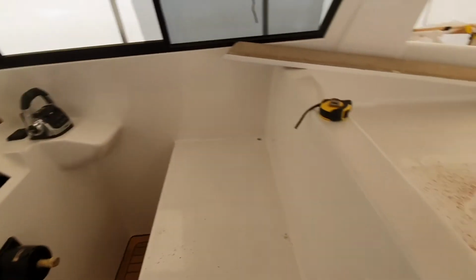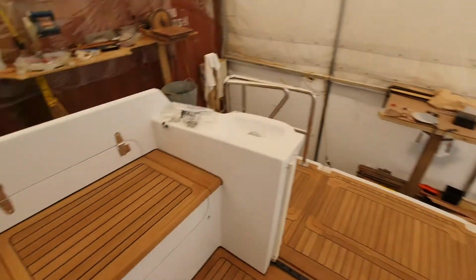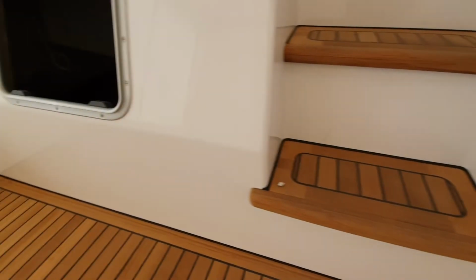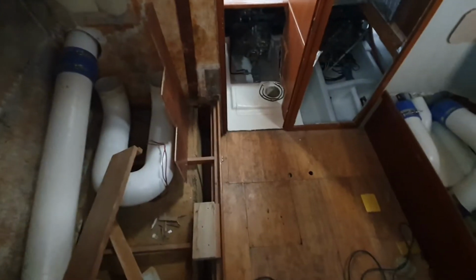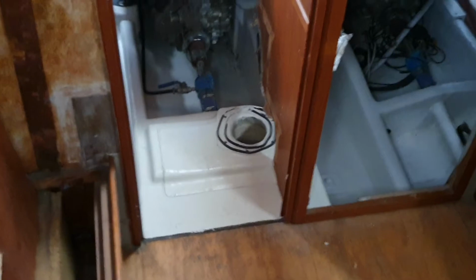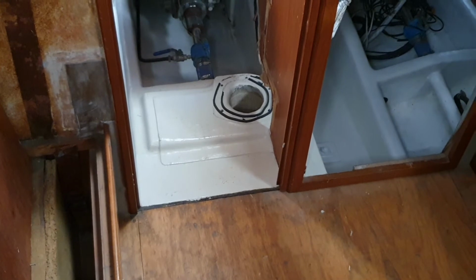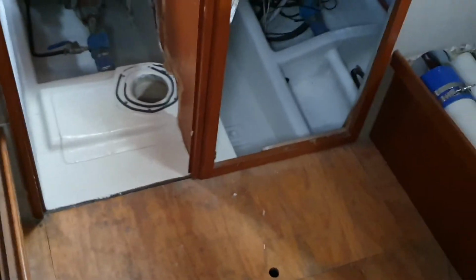Now the boat had a bit of a messy exhaust system all out one side, and I've built, if you can see it, I built that water trap muffler down there in place, and I've done all the exhausts. That's the starboard side. The port side, these are components, but I've boxed in between the engine beds and created a water trap muffler in that area, because there was really nowhere else on the boat for it, and yeah, I think it's going to work well, I hope.